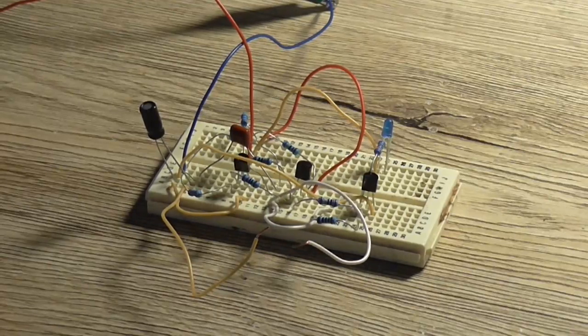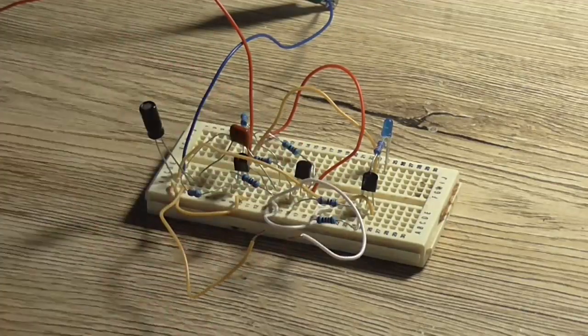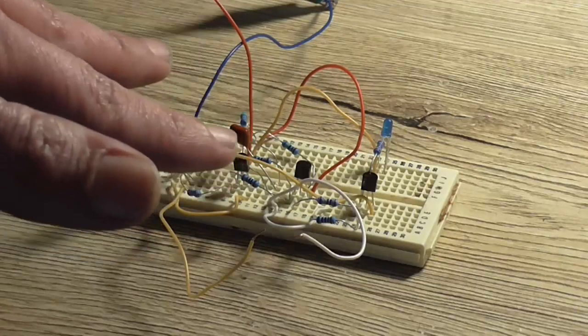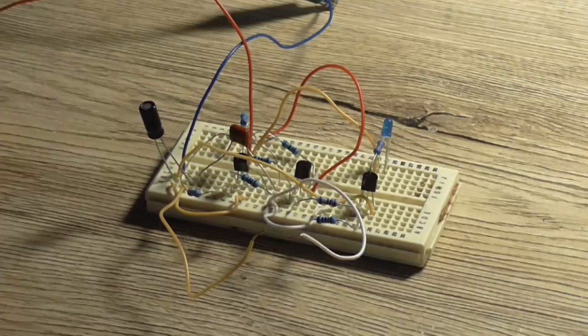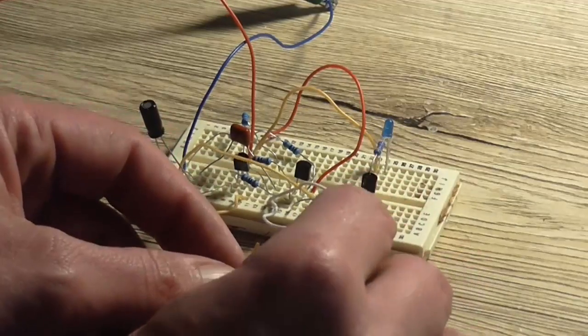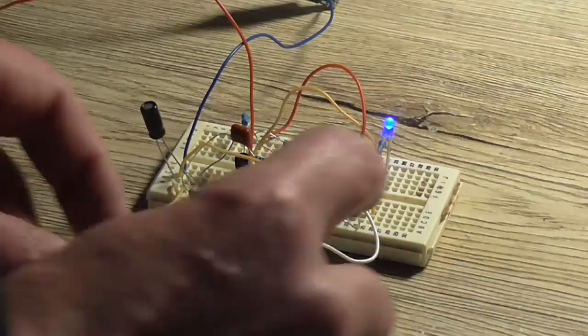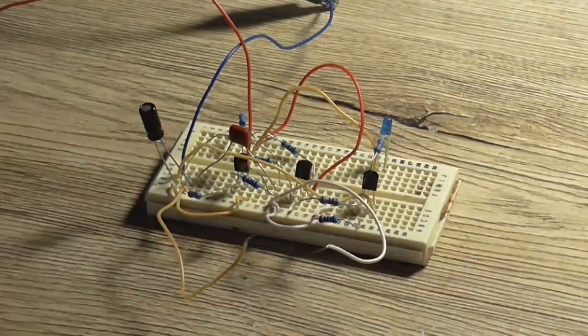Anyway, I've built the circuit. Had to make a few modifications because it didn't work — first the LED came on and stayed on. These are my switch wires here, the yellow one and the white one respectively. It wouldn't cycle through set and reset, so I'll go through the modifications on the whiteboard. But let's have a look at the operation. I've just turned the power on at 12 volts — it should work fine at 9 as well. Now if I touch the wires together like that, the LED comes on. If I touch them again, the LED goes off.